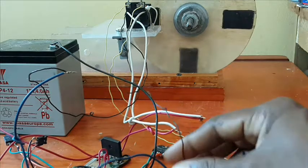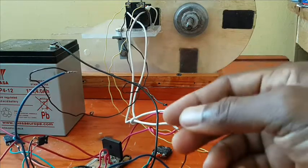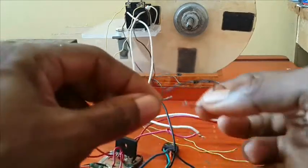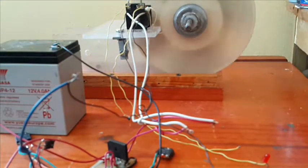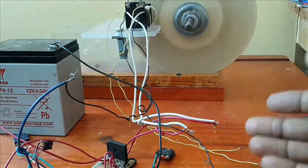Simple things like this. I have my run coil branched correctly, start run and end run. But my trigger is not branched properly. The start trigger is on the wrong input. So I'm just going to switch the end trigger position from the start, and check this out. The motor is running, baby. Running. Okay, so that's what you need to understand. If it's not the trigger, then it's the run. You have to switch positions.